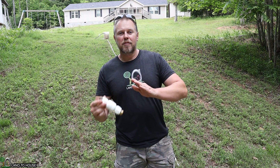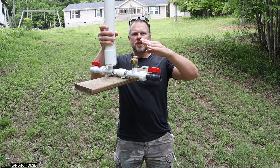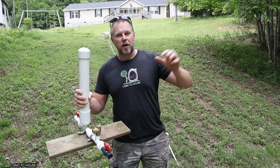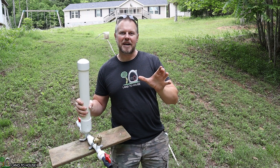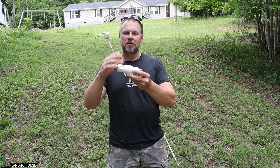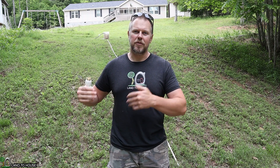There is a concept with the ram pump: if you put an inline valve, such as this one right here, in the delivery pipe going uphill, it will hopefully increase the output of the pump. As the ram pump cycles, the waste valve will slam closed, and when it opens, there's a moment where the pump is not pushing water out. That moment is where the water in the delivery pipe can fall back down a little bit, and the inline valve will prevent that from happening, so the pump has an easier time pushing water up and can push more water with each cycle.